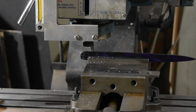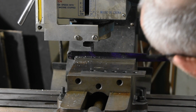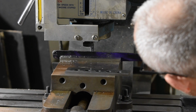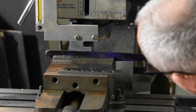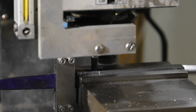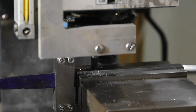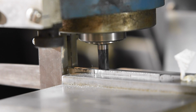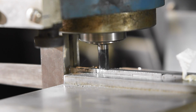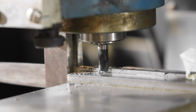Before grinding the bevels into the blade, I'll shape the tang. This is a pretty complex and in some respects dull process, but if it's not done carefully, you're pretty much sunk. First, a step has to be made on which the brass guard will sit. Then a stick tang will be shaped on which the lathe-turned wooden handle will be seated. Finally, the end will be threaded to accept the pommel, which will screw down and tighten the whole handle assembly together. Most of this work is done on the mill.